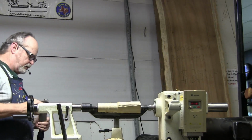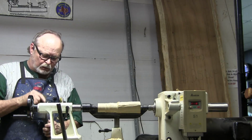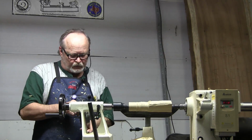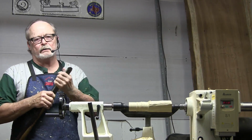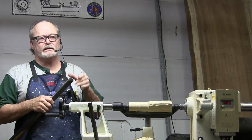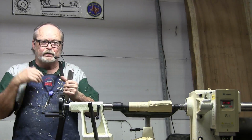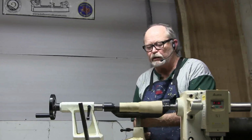Kind of abused him here a little. And when you hone, it's almost always under 30 seconds is all it takes. If I have to hone more than a minute, I need to be at a grinder. So don't let anybody tell you it's a waste of time. You've got to sit down, chant a mantra, and just do this and do this. No, it's very quick. It's like a cold swim, in and out. So here's the planing cut.